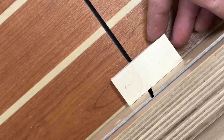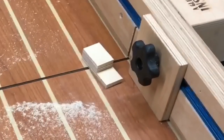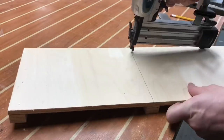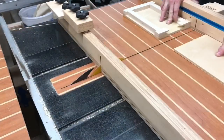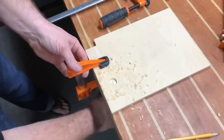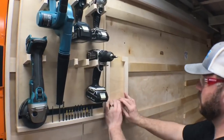My favorite challenge of this build was getting the circular saw up onto the wall safely and effectively. I'm incorporating stop blocks on little pieces of 3/4 inch plywood and nibbling away some material to create a bracket-type piece. I make marks so I know exactly where to put these pieces that are specific to the size of my circular saw. CA glue and activator hold it initially, then I come around the other side and reinforce with brad nails. I cut a few side supports, hand sand them, and install them with glue and brads. After trimming to size and sanding, I realized I needed a half-blind semicircle cut out of the piece to incorporate the stop block that holds the base of the saw into the bracket. I had to follow my nose, referencing the tool I was building it for, and the results turned out great.